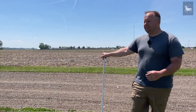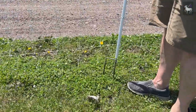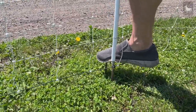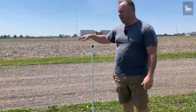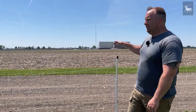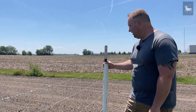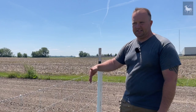I really like the Permanetting — it's a little heavier duty. It's got a double step-in spike that you can see right here — pretty well stuck in the ground. You just press it down into the ground with your foot. This is a pretty heavy-duty system, at 48 inches high. I don't think that's necessary for most sheep or goats, but it's the height it comes in and we think that's acceptable. You can also get drive-in posts for those of you in areas with extremely rocky or extremely hard soil. For the corner posts, the easiest way is to drive a T-post and put a two-inch piece of PVC over top of it — it insulates the entire post and you can pull nice tight corners around it.